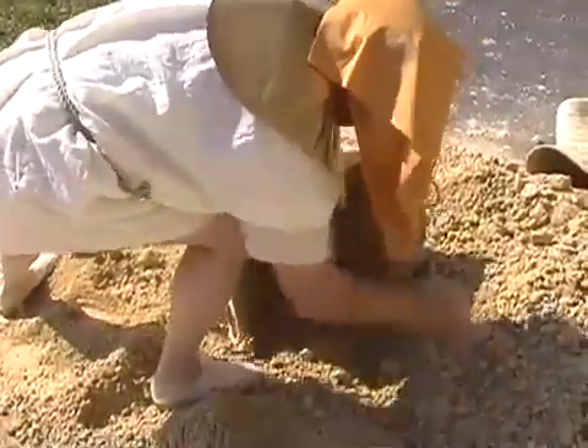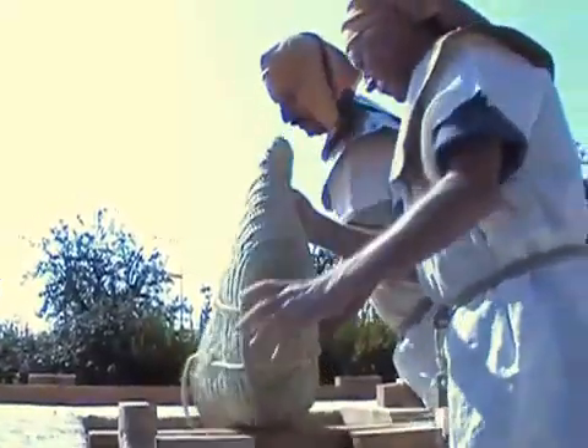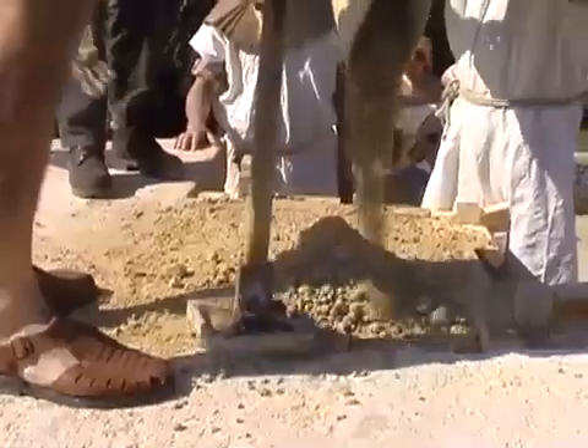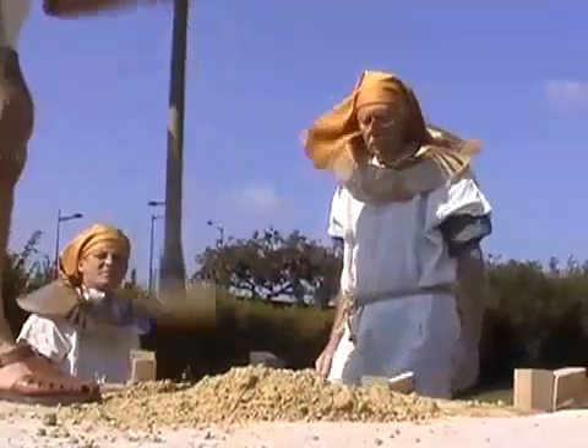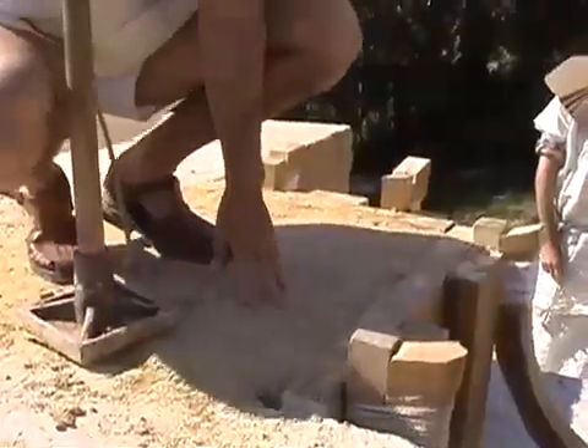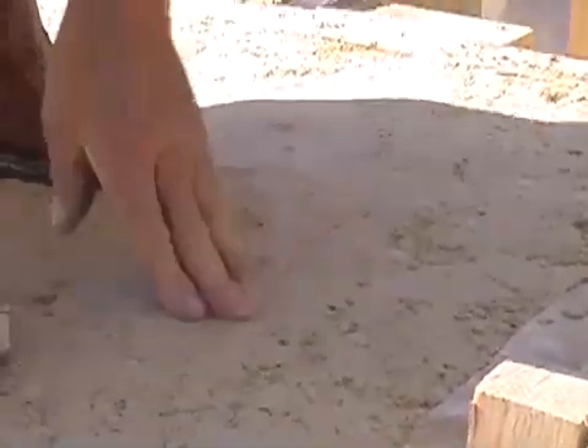We do all of the work manually, forming a human chain carrying buckets from the mixing area to the mold. We pour the limestone-concrete mixture into a mold and pack it down with a tool called a rammer. Compacting the material requires little effort. The packing operation encourages cohesion, and the denser mixture takes on high strength from the initial curing phase.